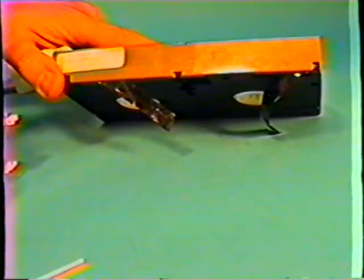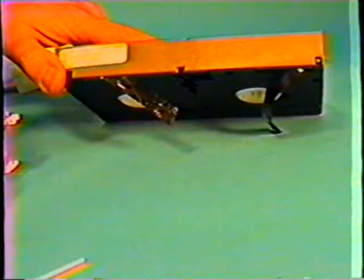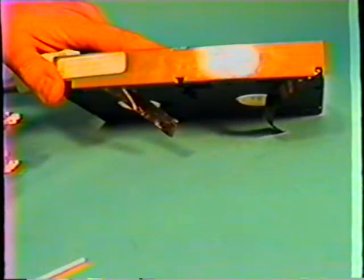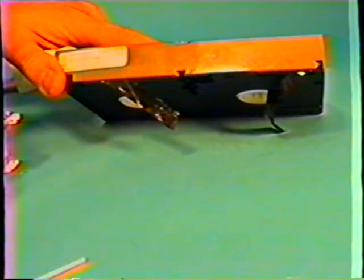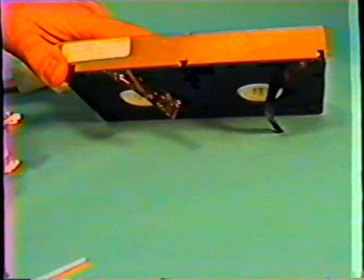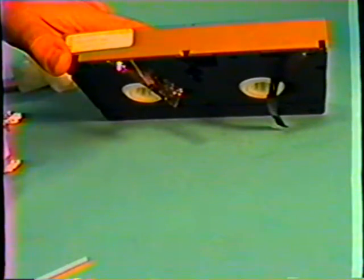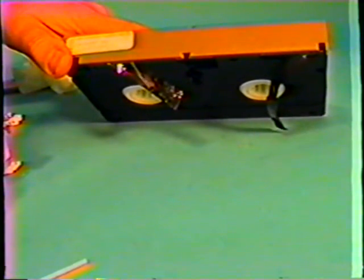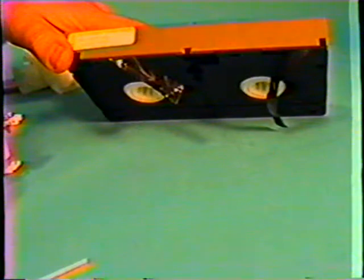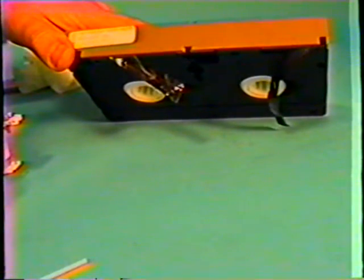But they had the tape in their car for about an hour. They went shopping. They came home, and they put the tape into the machine, and the tape started to warm up very rapidly because the house is now 70 degrees. And because the tape had moisture on it, it stuck to the head assembly and tore it. And it took approximately 5 seconds to do this much damage.